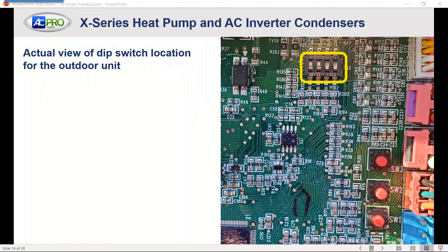This is what the dip switches look like on the actual board. The little block on the board appears to be upside down — not sure why, but you've got your identification for dip switches one, two, three, and four, and which position is on and which is off. Right now one and two are in the on position, three and four are in the off position. They're very small — you'll need a small screwdriver. Always turn off the power before you change a dip switch.